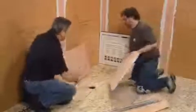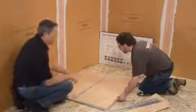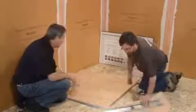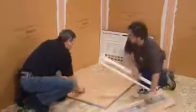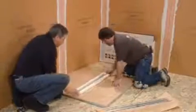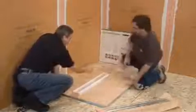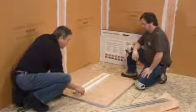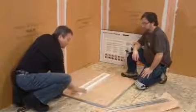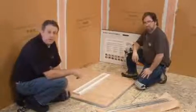Now you can see we have a hole in the floor here, so we're going to put one section towards the back, and then we're going to have our intermediate placement of our drain right here in this low section. So we have this little channel right here. The next thing we're going to do is put in the support. We're going to notch out both sections of this tray to make room for this support so it can sit down flush to the tray. Then we'll be ready to put our KERDI-LINE drain in.